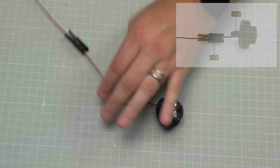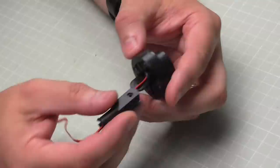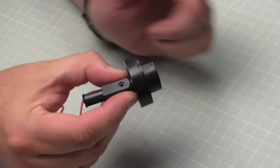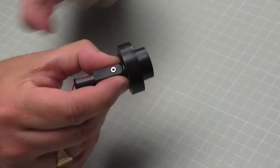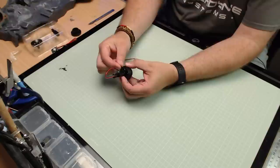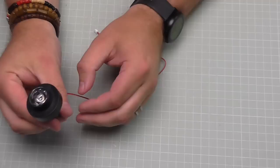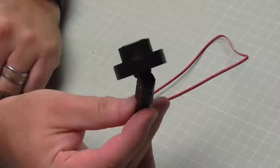We're going to be putting these two holes together so we can put a screw through, making sure we're not pinching the wire in between. There's a hole for a nut so we drop a nut in one side, then using one of the large black screws we go into the other side and tighten that up. That is one spotlight done — you can tilt it either way to direct it. That's the red one, so I'll keep that to one side.